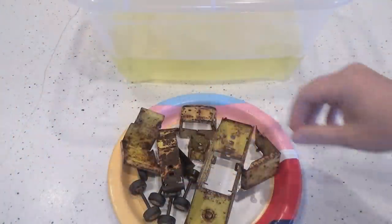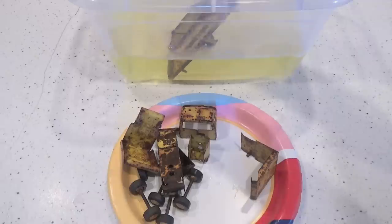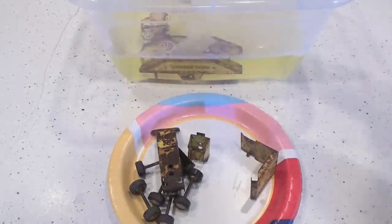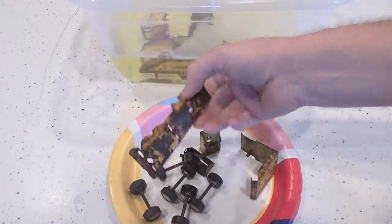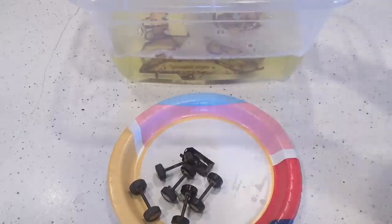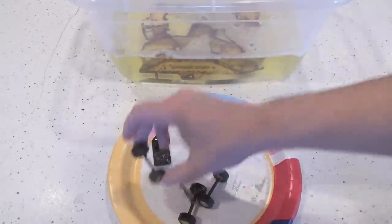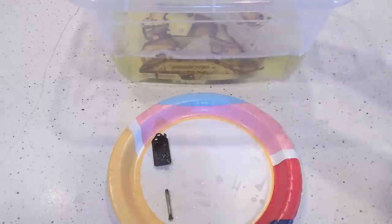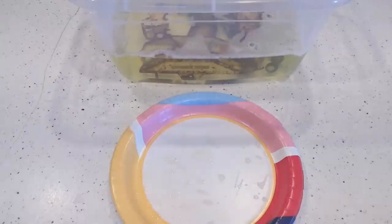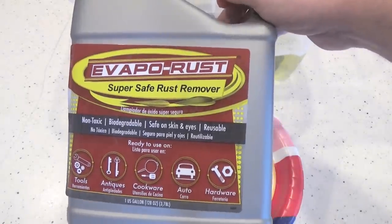Since we're on the subject of rust, I decided to attack the rust first. Items that are extremely oxidized make paint removal very difficult because the rust protects and holds the paint in place — by removing the rust I'll also be removing quite a bit of paint that was only held on by it. I'm using Evapo-Rust to dissolve all the rust from these parts. This stuff works great and I highly recommend it for mild steel parts like this toy. Where these solutions tend to fail is on hardened steel items like metal files and drill bits. I'm not being sponsored — I just picked this up at the auto parts store.